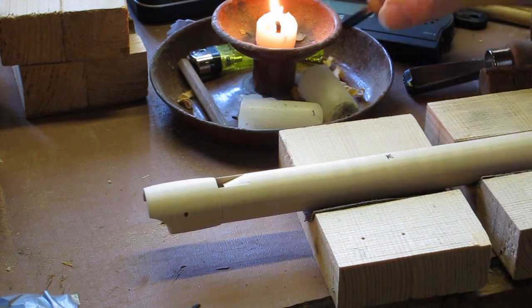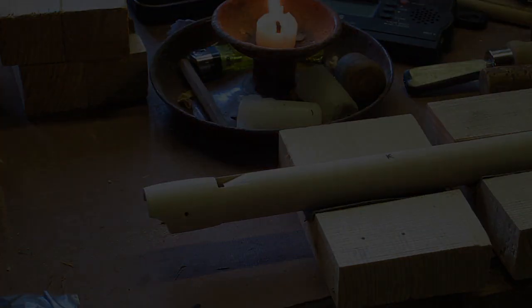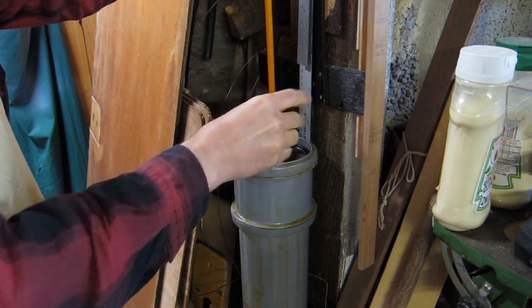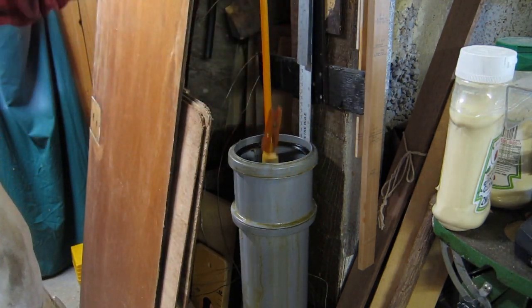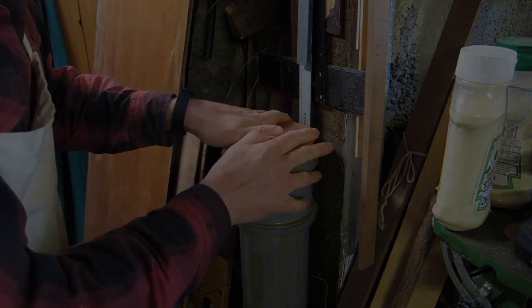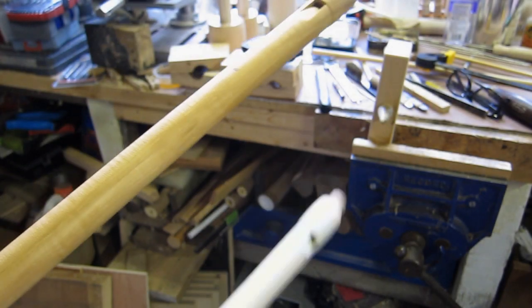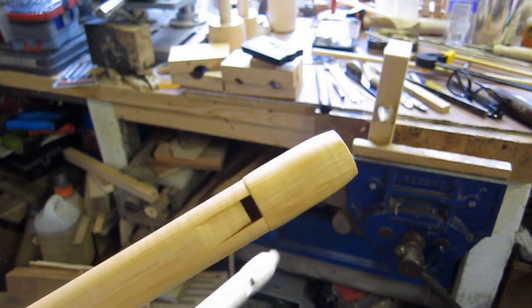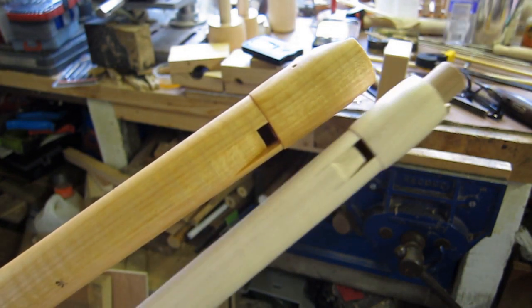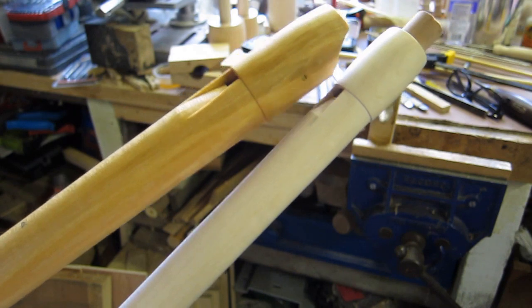It's held in a candle, which gives it some candle black. Then it goes in linseed oil, stays in for about a week, and takes about three weeks to cure once it comes out. You can see it's already changing color — this is what it looks like before: plain wood, and there afterwards. It takes on that golden color and shows up the grain — you can see a nice figure there in that bit of sycamore in the left-hand one.